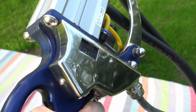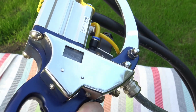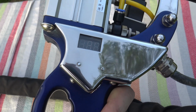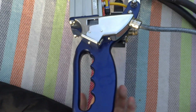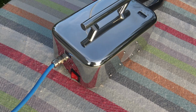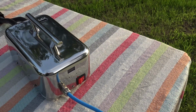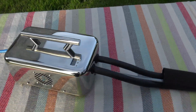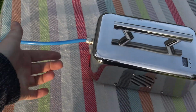That wee enclosure was also made out of 3 or 4 pieces, but I tried to make it as close to one piece as I could. But as you can see, there's lots of corners and stuff on it around the switch. There's another control in there to control the pneumatic cylinder. Adjustable control. It's a microcontroller board. There's also another control in this, as I was talking about a minute ago. 2 switches. You can adjust settings in it. So basically, it's a clock pulse timer. I could have used an Arduino or something, but at that specific time I didn't. I wanted to keep it simpler with no programming, but I can actually program them boards using the buttons there.